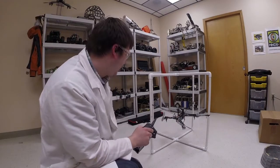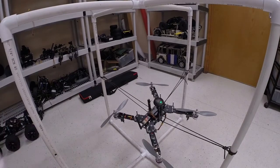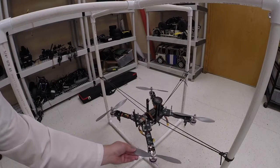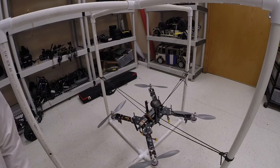You can see it's not really flying at all — it's hitting the wire and the propellers are just going crazy. We actually have all the propellers on not just backwards but upside down. That's what it looks like when the propellers are mounted upside down.